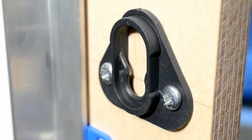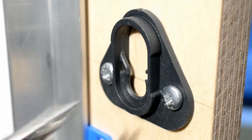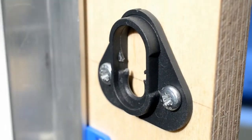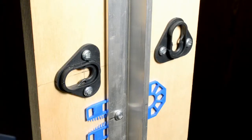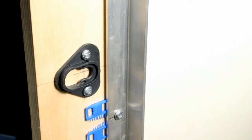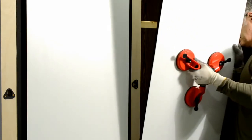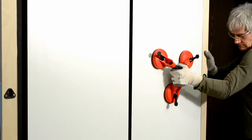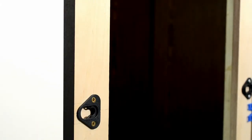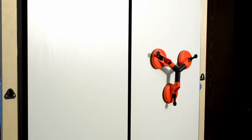In some circumstances you may want the panel to be easily removable, so you can reduce the strength of the click fit by snapping off the little ears of some, but not all, of the fix mouldings. Just in case the plastic fragments fly off, always wear safety glasses when doing this. At this panel junction, the architect has detailed a visible metal edge between panels. With the 8mm gap created by surface-mounted fixes, there is sufficient space to screw an aluminium T-section to the batten behind the fascia panels. We have also orientated some of the fixes here so that the fascia panel slides on sideways rather than dropping down vertically. Both methods are just as strong, and you can choose the orientation that best suits your application. A suction pad makes handling the panel so much easier. To engage or disengage the Type 1 button fix, the panel needs to slide by 15mm. The 25mm flash gap detail gives you plenty of clearance for this panel to disengage sideways. If your button fixes are orientated vertically, you will need a similar gap above the panel instead.